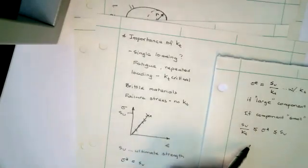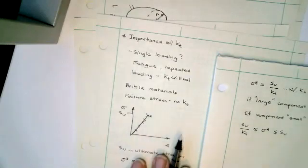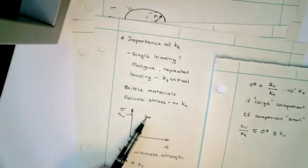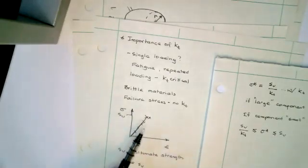If you think about paper, it's fibrous. And as a result of all these fibers, it has built-in local stress concentrators, and they're very small. When your stress concentrator, let's say, to fix ideas, it's a hole, gets down to that size, then it just mixes in with all the stress concentrators. Those are the little local stress concentrators at the end of fibers, and that's what's breaking. SU is something like Young's modulus upon 1,000. If you didn't have those local stress concentrators, then SU would be something like Young's modulus E upon 10.